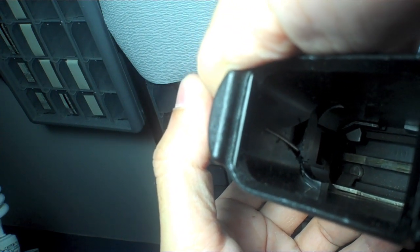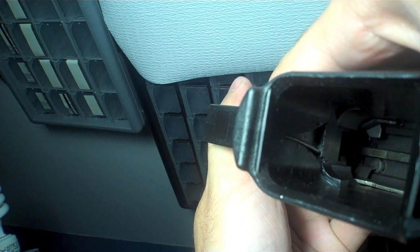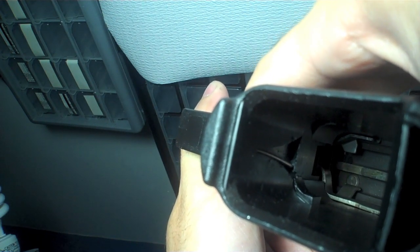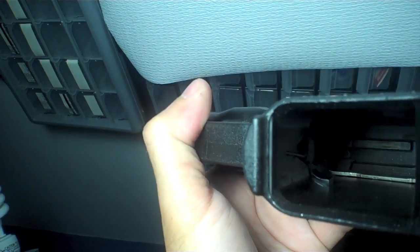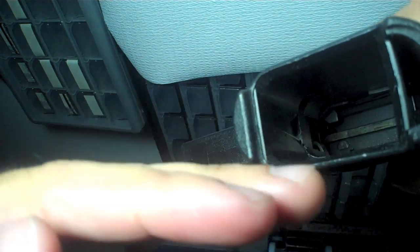But then with the complete pull — you can't really see it on camera — let me try that again. So that's the initial trigger pull, then the complete trigger pull. Basically what I'm seeing, which you can't really see on camera, is the trigger bar is being twisted or bent down sideways towards the frame this way.